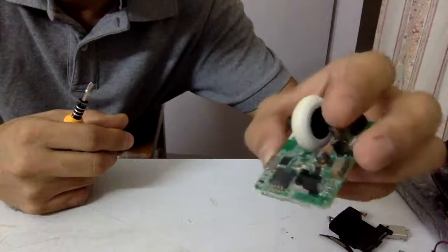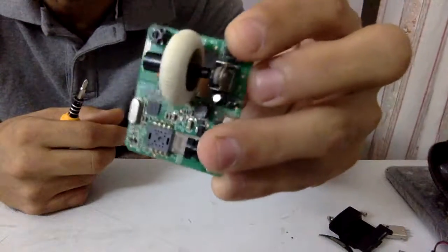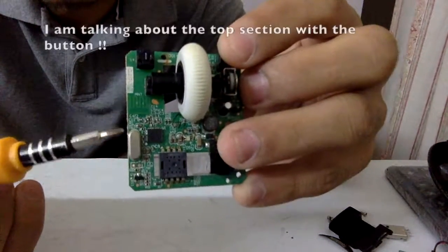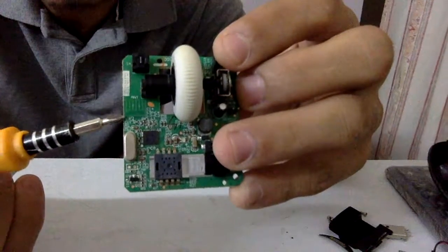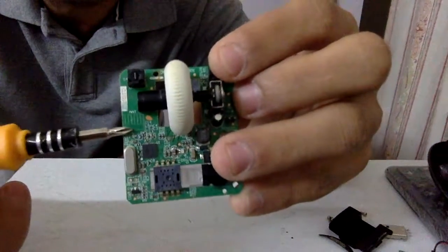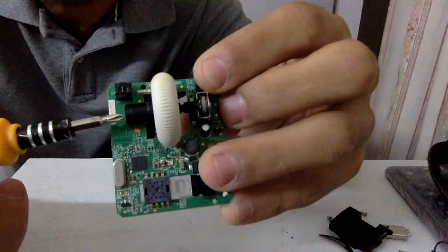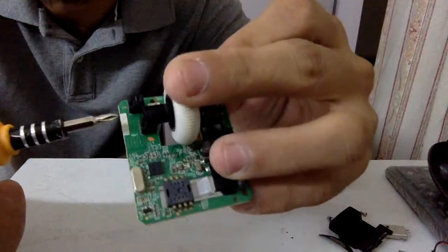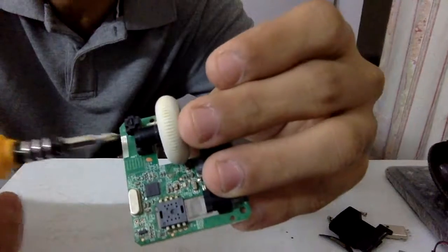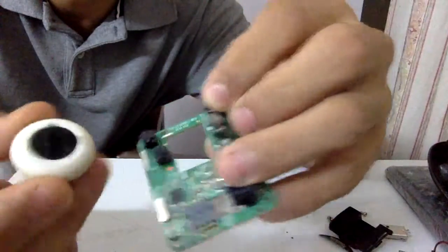I finally have the circuit board — looks pretty neat. First thing I check is how they implemented the RF section. The RF antenna is right next to the active components with barely any air gap for radiation clearance. And on this side, there's a small switch sitting directly in front of the antenna — you can feel the small clicky sound when you press it. I never expected this from a Microsoft product.